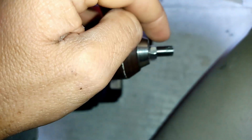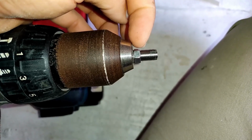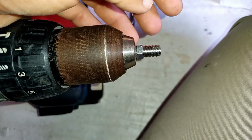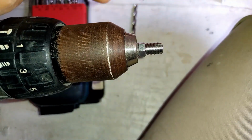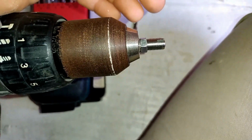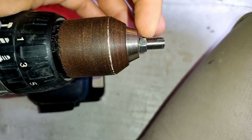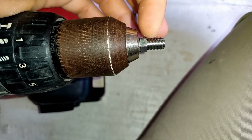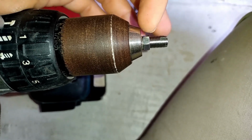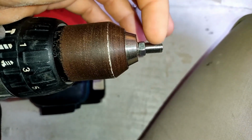bit. And when it did that, it made putting the bolt in really hard because it squished the end. It was a pain in the backside. I won't say it was a disaster, but it was really difficult, and I had to go and get my M6 tap, and then tap the inside of these thread certs just to give it clearance so I could actually get my M6 bolts in to hold my track on. So a little trick there.